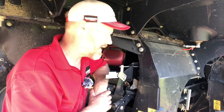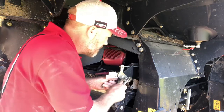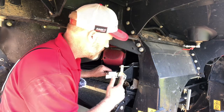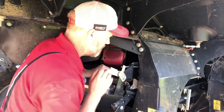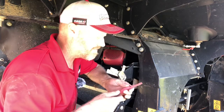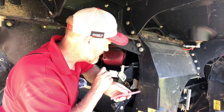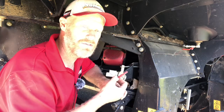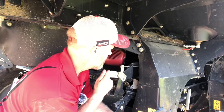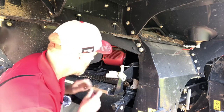If you've got the closed slat 1-5/8, you'd calibrate it to 10mm. The way we do that is loosen this bottom bolt off — you can see it's on the slotted hole there. I've got it in the fourth notch, and now I'm going to push it closed. Then I'll take my sieve gauge and go up front. Ideally with two people, one can sit here and slide it back open. I'll open it a little bit, run up and check it with my sieve gauge, and come back and adjust if needed. I'm at about 4mm, so I need to open it a little more to get to 6. Now I'm at my 6mm, which is about where I need to run with this machine in corn. So now I'll lock it back down.